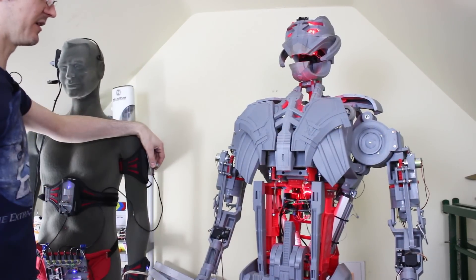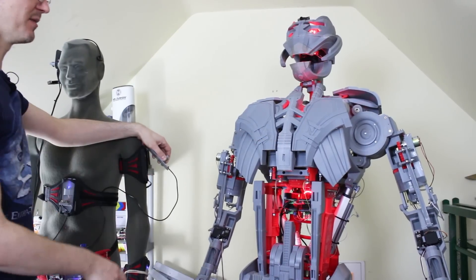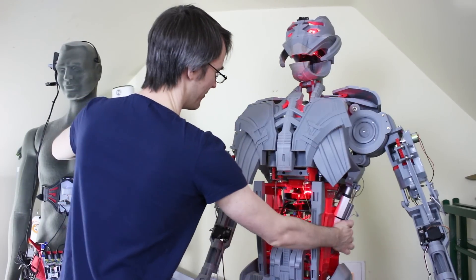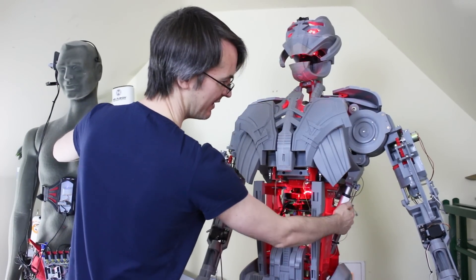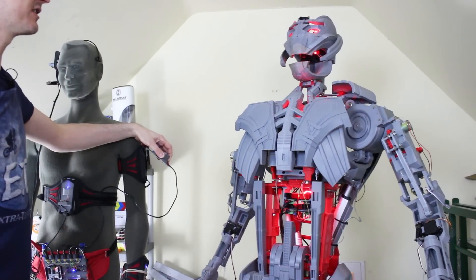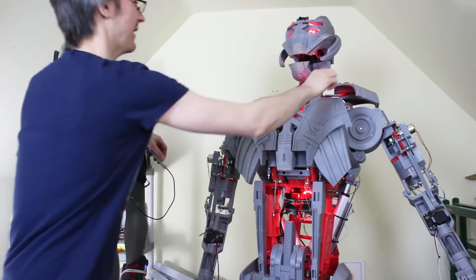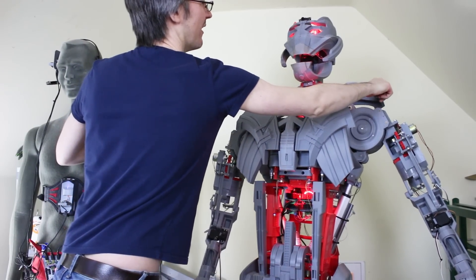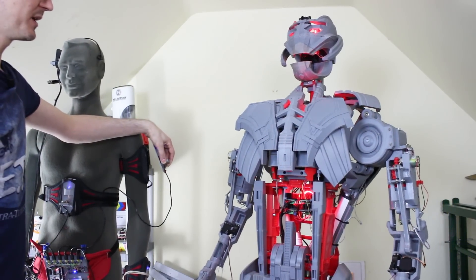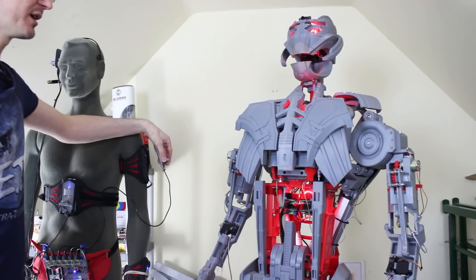I've now coded in one more axis — the z-axis to lift the arm out — so if I move this up we should find the arm moves up. I've made the arm less sensitive than my motion but it does work. There's no motion smoothing yet, and I 3D printed the wiper for the stick on the slide pot on these actuators but it's a bit loose so the feedback isn't quite right. The shoulder bell gets stuck on its runner too, so that needs to be looked at.